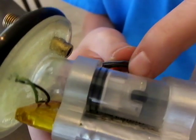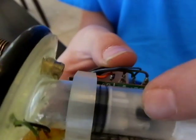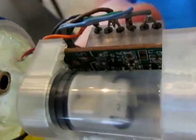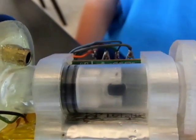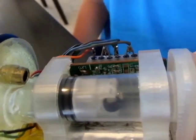We made a 3D printed part, and we made tiny wheels to roll on the syringe — it has three little wheels on it to roll on the syringe so that the syringe doesn't get scratched by the plastic. That really helps so that the syringe stays sealed and it doesn't leak water into the mechanism.